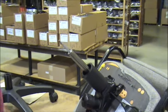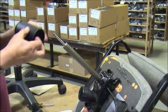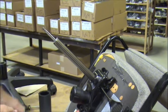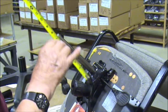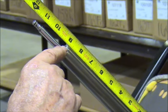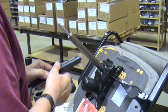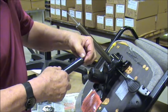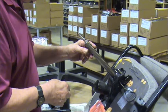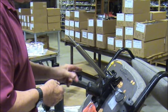We're going to go ahead and remove this telescope cover. Just pull it straight up — it has a small opening which fits over the gas cylinder. I'm going to measure the gas cylinder body by putting the end of the tape down onto the mechanism. This one shows that it's nine inches long. There's one inch of the gas cylinder being held by the mechanism, which also contains the activation button. So nine inches for the body plus one inch being held makes it ten inches. You would order a gas cylinder that is close to ten inches.